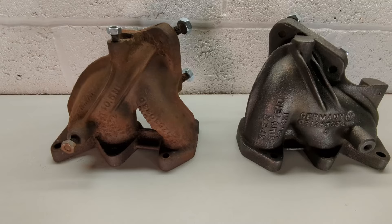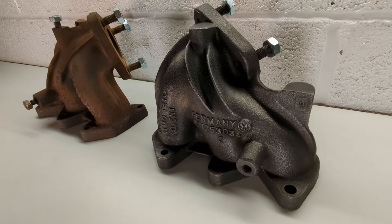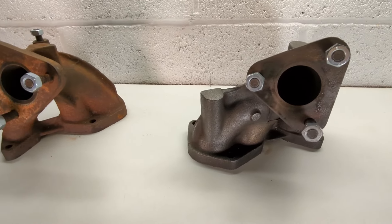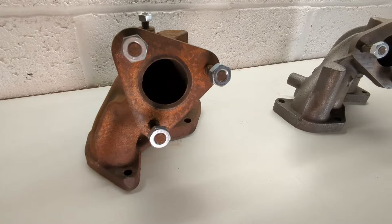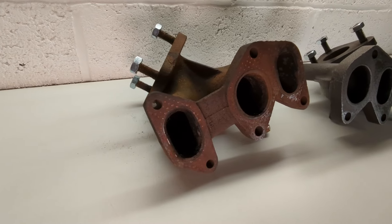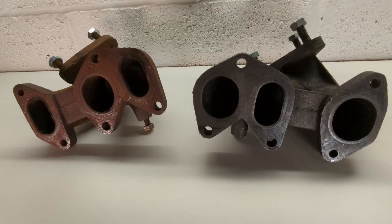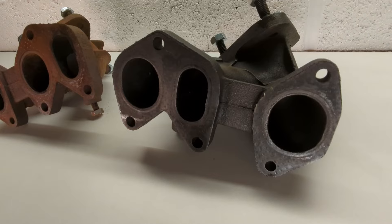To finish I wiped them over with a very light coating of oil to prevent re-rusting while in storage. If you've never done this before, I suggest you start with something small like rusted bolts or a small bracket and work your way up to larger more complex parts. An easy way to remember which way around the terminals go is the negative side goes on the part you want to de-rust - as you want to minus the rust. There will be a little transfer between the two materials, so as the rust transfers off, the sacrificial metal will transfer onto your part and over time will be eaten away. It won't damage a part like shot blasting would, but it is a slow process and there will be small amounts of oxygen and hydrogen given off, so make sure you're well ventilated. And if you want to see how I made the art for the thumbnail for this video, I'll leave a link. Any questions, let me know.